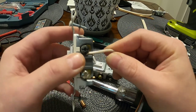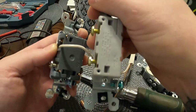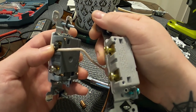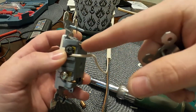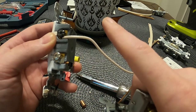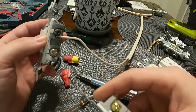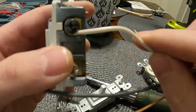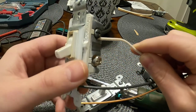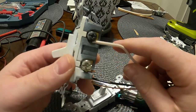Sometimes when you pull receptacles out, you'll have wires back-stabbed in the holes. Don't do that if you can avoid it — backstabbing's not cool. There's no reason why you should have a bare switch with nothing on the screw terminals when you could hook it up properly. If you do have to remove a backstabbed wire, there's a little slot on the device — you can take a small wire or flathead and shove it in there to unlock it, then pull the wire out with needle nose pliers. Also, be mindful that little copper ends could have current on them, which is why it's important to check that everything is off before you operate.